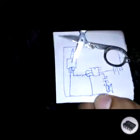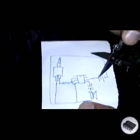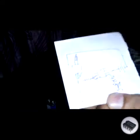...3.5 millimeter audio jack. From there it is also going to the 9 volt battery negative terminal. The positive is going to the second terminal, and from the second terminal of the other side you can see the 10 kilohm resistance is connected to the audio jack. The audio jack connects to the left and right channels — we have to connect the left and right channels together.